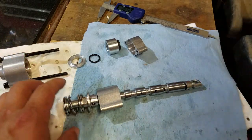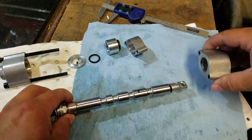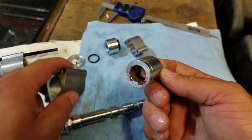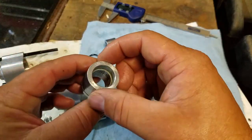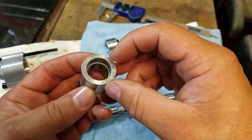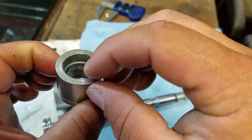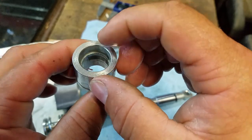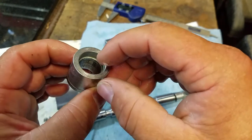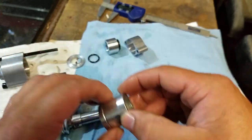Taking the back cap off — I think it just has some hydraulic oil in it. Inside here is a spacer and some other feature. This notch goes on the bottom side of the valve. You can almost see in here where the ball bearings ride — this is part of the float assembly. This piece has a deeper shoulder while the other has almost no shoulder, meaning this ID is smaller than the other.